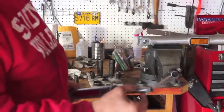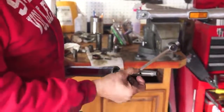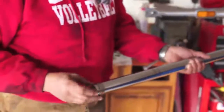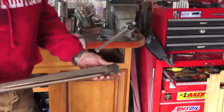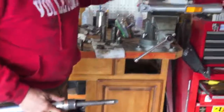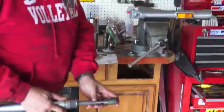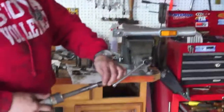The slider slides over the tube and goes right there. We slid the rebound shaft back inside and put the little clip back on. Then you've got to take this slider and slide it down like that. Then you've got to take one of these little pieces that usually gets stuck in the bottom of the fork. Put the skinny end up — it goes right there inside, and this sits in the pocket right there.